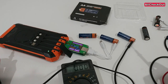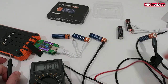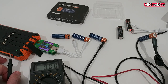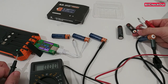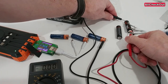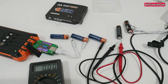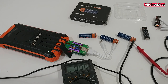With some other ones — I think with this one we had even more than 6 volts — so you have to be really careful. By the way, this is not just regarding this manufacturer or just lithium-ion batteries rechargeable with USB-C. I have one here which is also lithium-ion but rechargeable with micro USB, from a totally different, big brand. And you can see on the left side: 6.23 volts. Exactly the same thing. So they seem to have this in common — they are definitely not intended for pass-through charging.